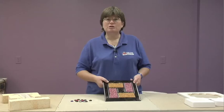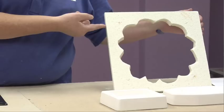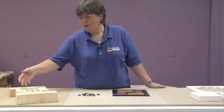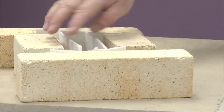Well, there are any number of ways you can achieve that, usually using some type of a mold like these molds here. These are ceramic molds made for casting, or this is a fiberboard cut out to make a mold — it can be filled with glass. Or over here you see a dam setup, using high-temperature ceramic dams lined with fiber felt and held together with bricks. Fill that gap with glass, and you can make as thick a bar of glass as you want.